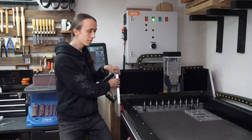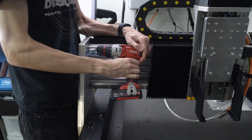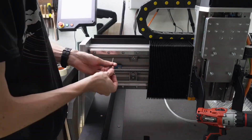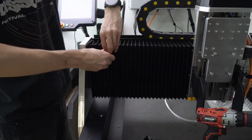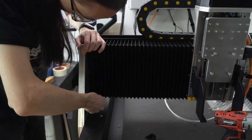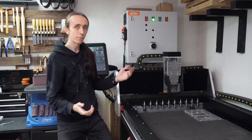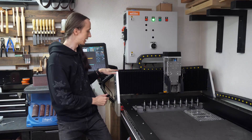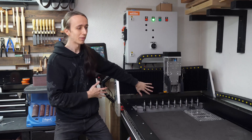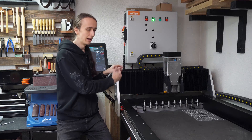I did not include any attachment points since I didn't really know how I wanted to attach them, and the material is very soft so it was easy enough to just drill those myself. I drilled three holes and then tapped matching holes into the end plate. I'm just using a couple of M4 flat-head bolts so they don't take up too much space. In terms of travel loss, I'm losing basically no space in the x and y direction. I am however losing a little bit of height, and that's just how I have it go all the way around. I knew that because I was designing the machine with these bellows in mind — that's why the gantry side plates are higher to match the height of the bellows, and it matches up on the bottom too. I designed it in with that in mind, so it doesn't look like the space is wasted.